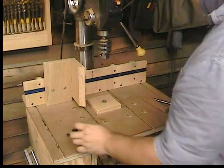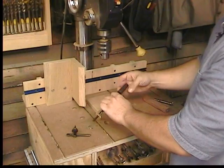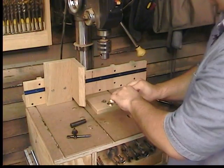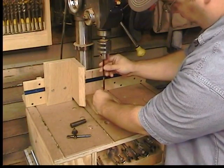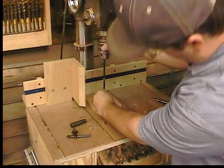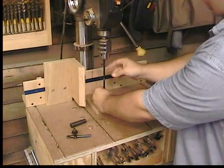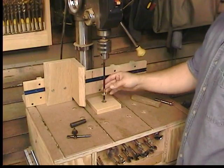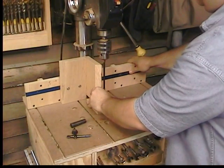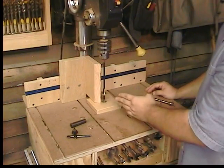I like to live on the edge — to push the boundaries between what's possible and what's just plain unbelievable. So naturally I wanted to turn pens on my drill press. It can be done using the exact same tools you'd use on the lathe. Just take off the tapered end, put the top on your live center and the formerly tapered end into the chuck. Your pen mandrel will work on the drill press and it's ready to put whatever wooden stock you want from your favorite pen kit. This feature of our table opens up a whole new world to a lot of woodworkers.